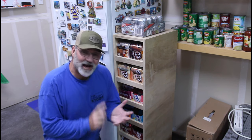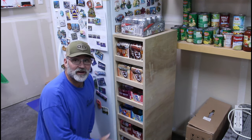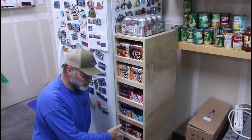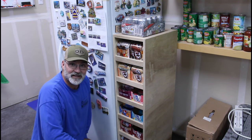A couple of things about this build: I used brad nails and glue, but you could use screws and glue, or screws only. Half-inch plywood is probably strong enough — just adjust the dimensions. Normal dimensions should fit whether it's half-inch plywood, MDF, or whatever material you choose. A safety note: if you have small children, consider anchoring this to the wall — there's a lot of weight here and it could tip over. I'd also suggest putting your less popular sodas at the bottom so it stays bottom-heavy and gets lighter toward the top.